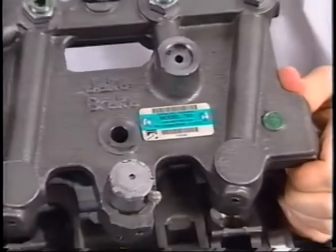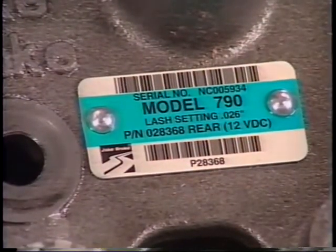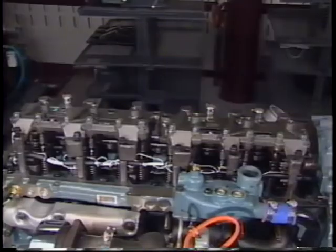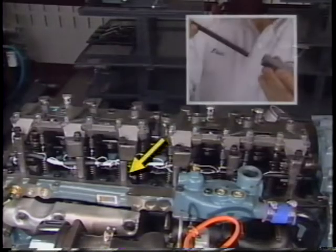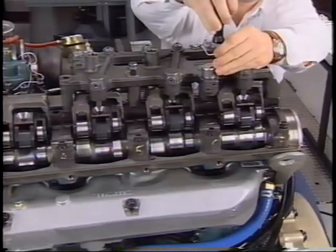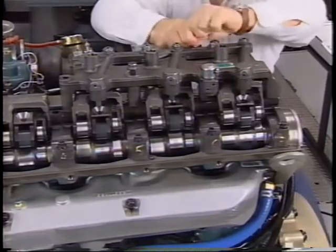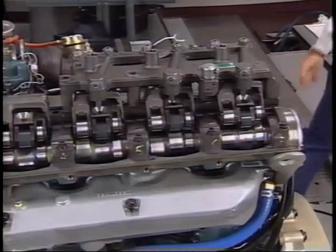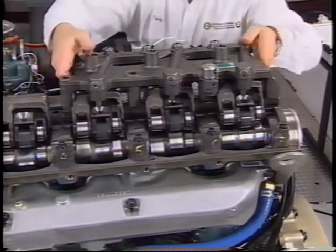If the engine being adjusted has the new design Jake brakes model 790, these new assemblies differ from the former assemblies in that two brake housings are used in place of three. The new brake mounts to the rocker shaft instead of the cam caps. More bolts are used to fasten the brakes to the engine and a tube spacer is used in place of the spacer bars. The brakes have dual slave pistons and coil springs in place of torsion springs to retract the slave pistons. As with previous Jake brake models, it is possible to check intake and exhaust valve clearance with the brake housing installed. However, before engines with model 790 Jake brakes can have valve clearance and injector heights adjusted, it is necessary to remove the brake housings.